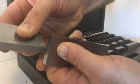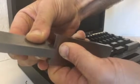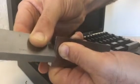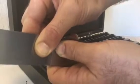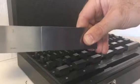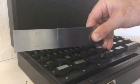I missed a little bit so I'm going to reintroduce it. Once I have a nice plus sign with a lot of pressure, I twist — and that removes the air. And there you go: two gauge blocks stuck together.